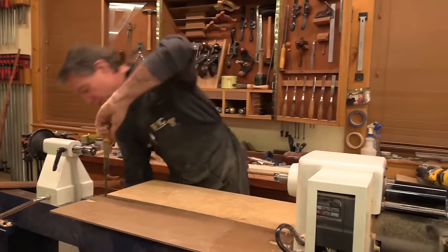It may be too much. But here's something I want you to see. Most lathes come with some type of indexing system. So this one, if you look right here, these three holes give you an opportunity to index the head. Can you see that secondary hole inside? When I rotate this, this pin goes in and it lodges in a hole and it'll hold the piece in position. And that's what you want when you're gonna route like this, you wanna hold it stably.